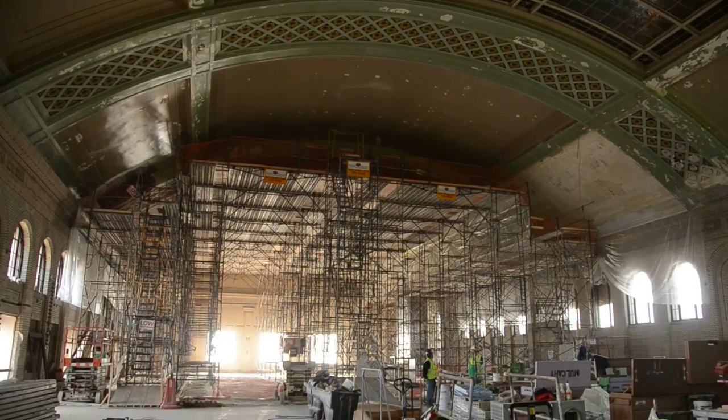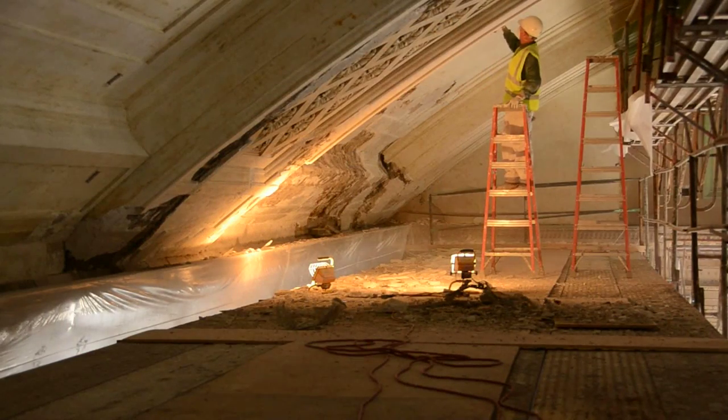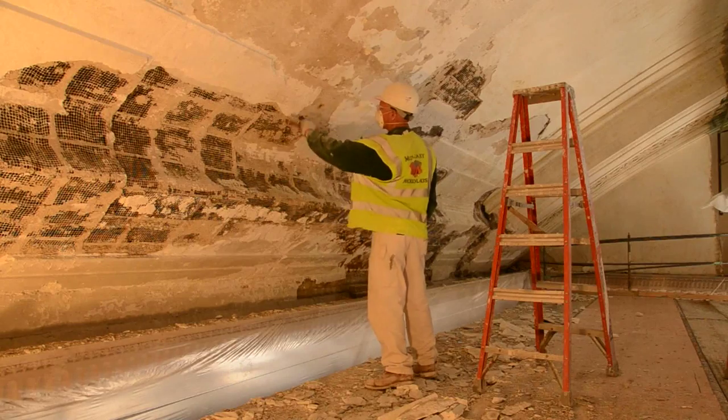There's a big difference between being 40 feet away when you're on the ground versus 2 feet away from the ceiling where our scaffold is. It may not show up at the surface, but the backside of the plaster will actually just become brittle and just falls right out of the lath.